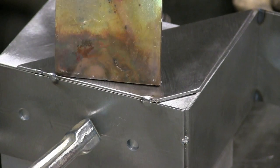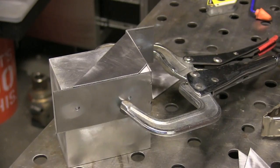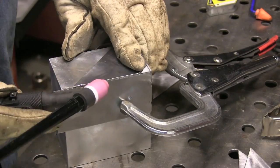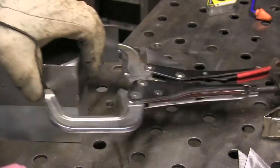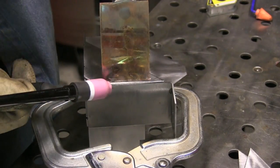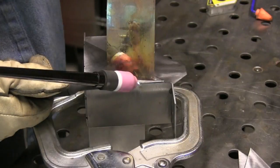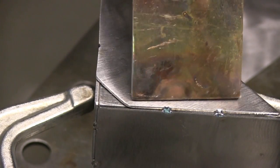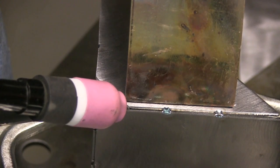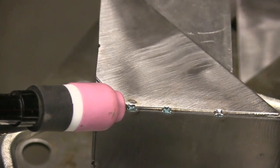Let's speed the film up and show you how quickly this can let you put some stuff together. Using the torch switch, it just blasts the amperage — you don't have to wait for the foot pedal to stroke up and down. You get no discoloration and it's very easy to weld over those tacks. I'll do one last one here — you might notice I'm propping the cup, touching the metal, then rocking it back just a little bit, and then blasting it with amperage.